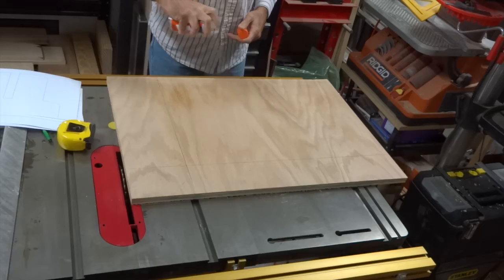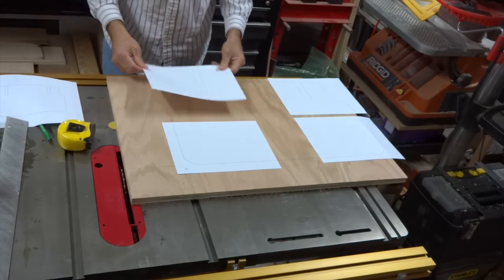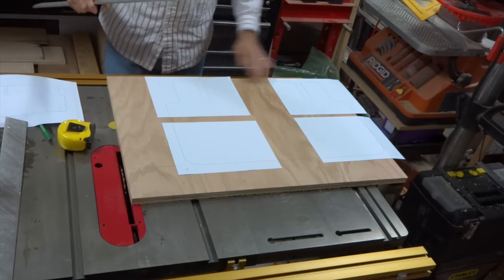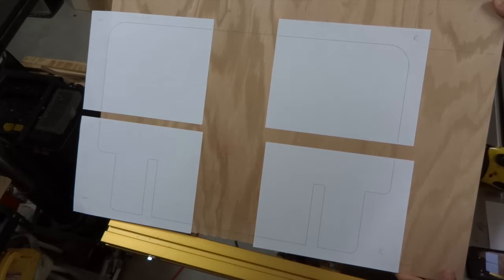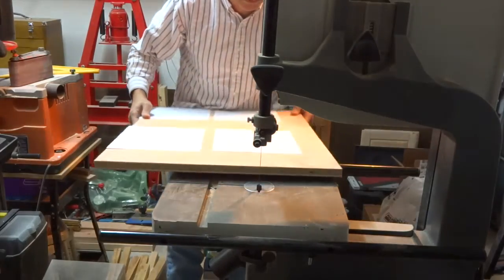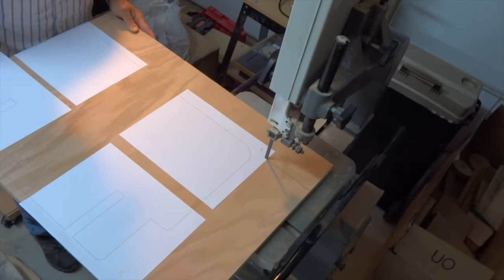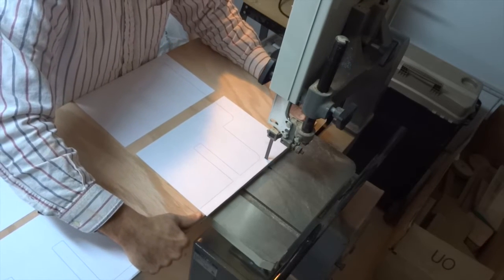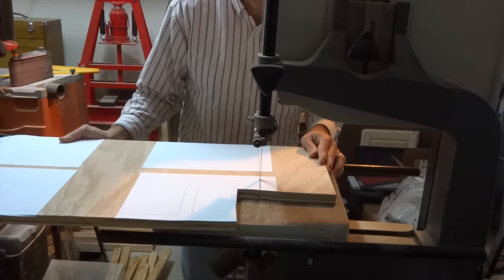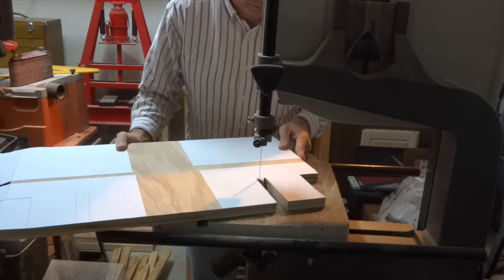The next part I needed to make was a platform out of three-quarter inch plywood. Before I could cut out the shape, I needed to attach a paper pattern to the piece of plywood. Due to the large size of the pattern, I printed and cut out only certain parts of it that I could then line up on the board. Next it was onto the bandsaw to start cutting out the shape of the platform. This process took quite a bit longer than I expected, mainly due to the narrow slots I needed to cut into this piece.